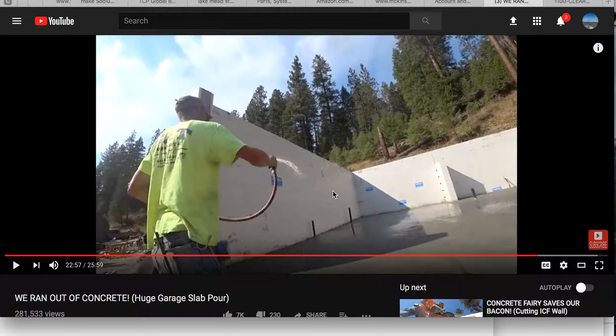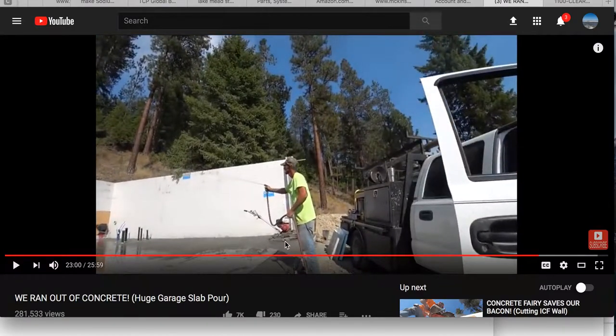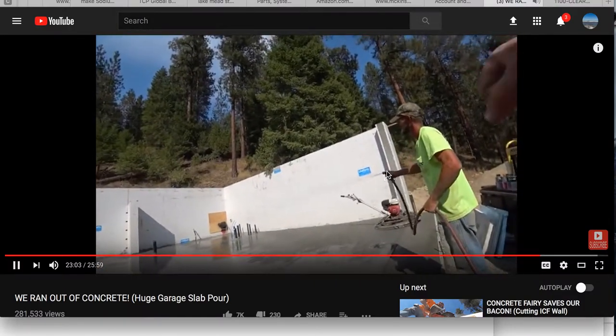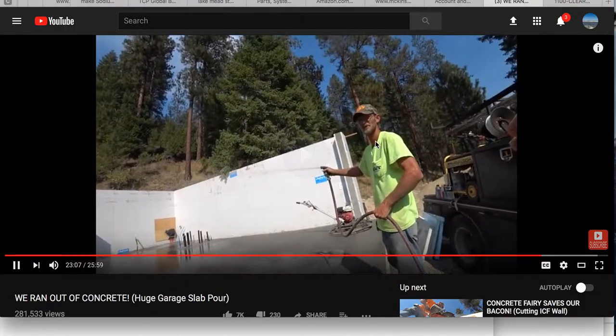You can hydrate your surface to help it not evaporate. You don't want the top to dry out too fast — that's why people use misters onto concrete, and some people use plastic. You just don't want the top to dry out too fast. This is excessive within the time frame of the finishing I watched in this whole video. There's a machine still on the pad. You can wet the concrete and kind of really rough it up to get the cream where you want it — this is how you cause delamination.